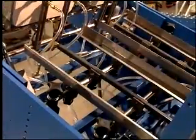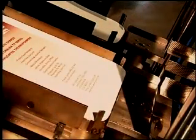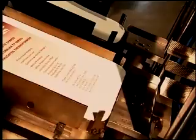These rails employ a center-mounted air manifold with angled orifices to float the blank down the rails under positive air pressure. This positive air pressure acts like an air hockey table to move the blank quickly into the forming die where it docks against stationary blank stops.